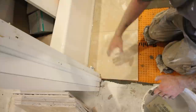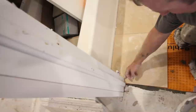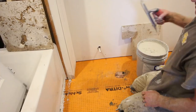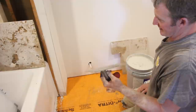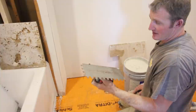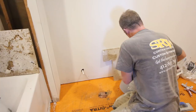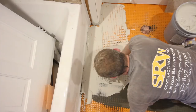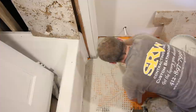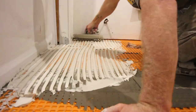What I normally do is go straight to the edge of where the door is, and always try to go into your door frame at least an inch so you can see all of your tile inside the bathroom. We're going to use a half-by-half square notch trowel for this travertine, which is almost half an inch thick. That really gives an extra bit of cushion and allows you to level it out. I'd also definitely recommend using a white thinset, mainly because you're filling in all those grooves underneath the stone and you don't want to darken the tile.